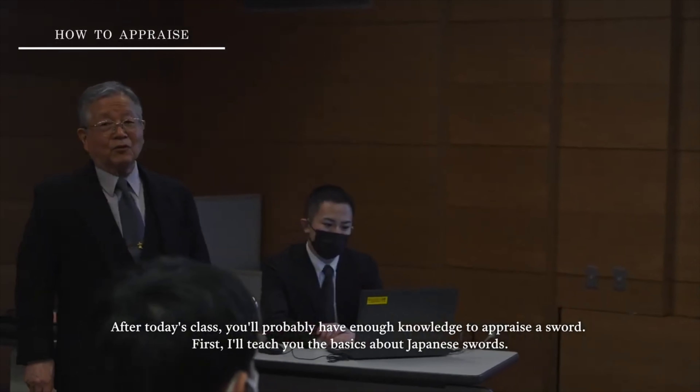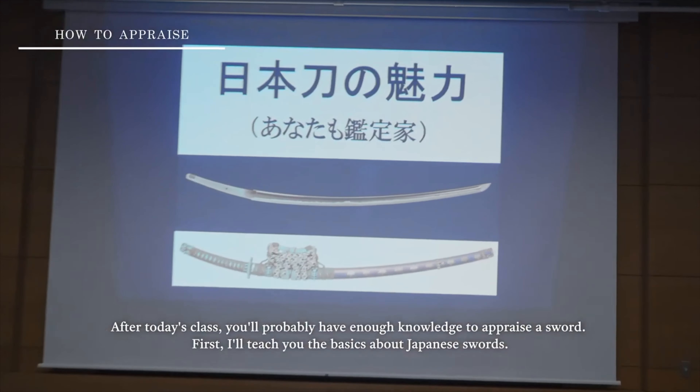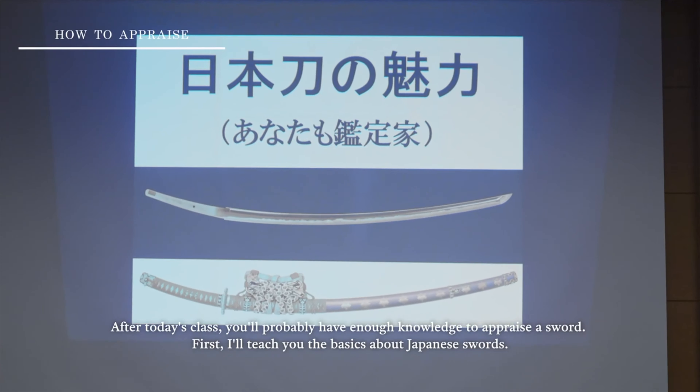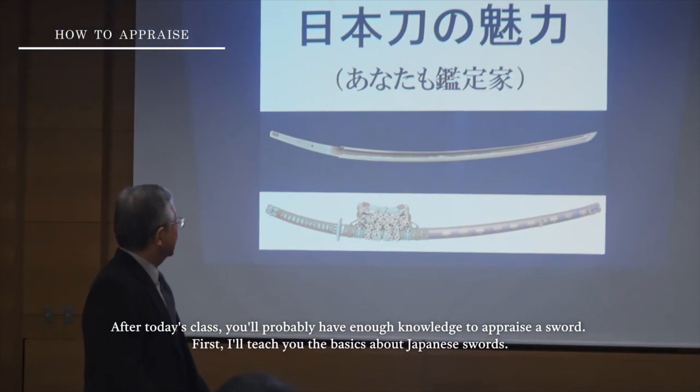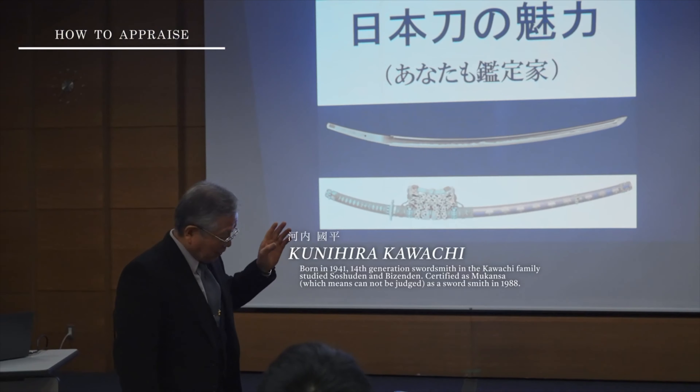Steel ranges from soft to hard. Homogeneous steel in terms of carbon quantity is the key for sword making. You have different steel types. Shigane is soft steel, equivalent to modern 1045 carbon steel. It is soft, does not keep sharpness well, but endures shocks and can bend easily.